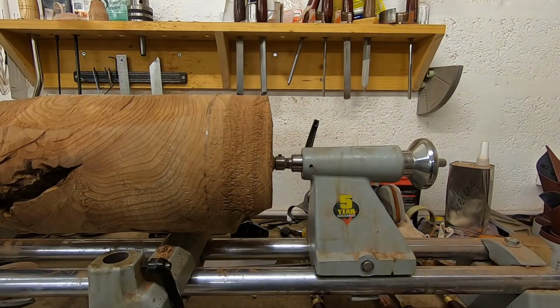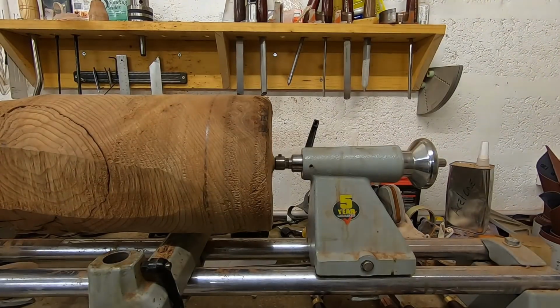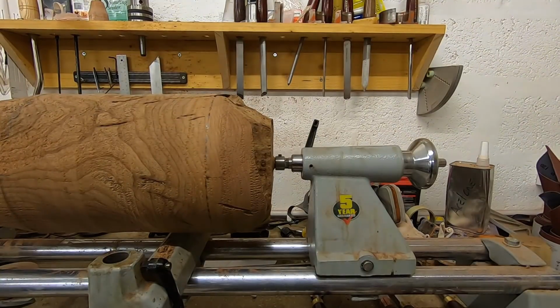Okay, that's halfway through now. It's only taken 3 or 4 minutes in order to get halfway. It is a bit longer than if I was going to just use an auger bit, but it's quite tricky to find an auger bit the size of something that you're going to work on, and also to keep it going straight and true through the workpiece you're using. So I really like having this long hole borer to be guaranteed a perfectly straight hole through the workpiece. So get this turned around, and in another few minutes the hole will be bored all the way through.